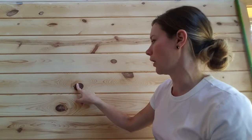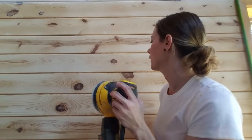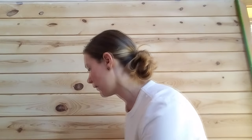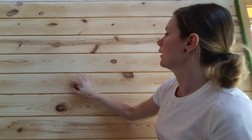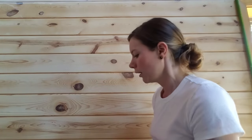The first thing we did was sand the wood to get the existing varnish off. I used this orbital sander with a 40 grit on it, and it didn't harm the wood at all — I just got the varnish off. Be aware it's a big mess, there's gonna be sand all over your house. But you need to sand it really good, and it'll come back to its natural beauty. It's gorgeous, but over time again it'll turn yellow.